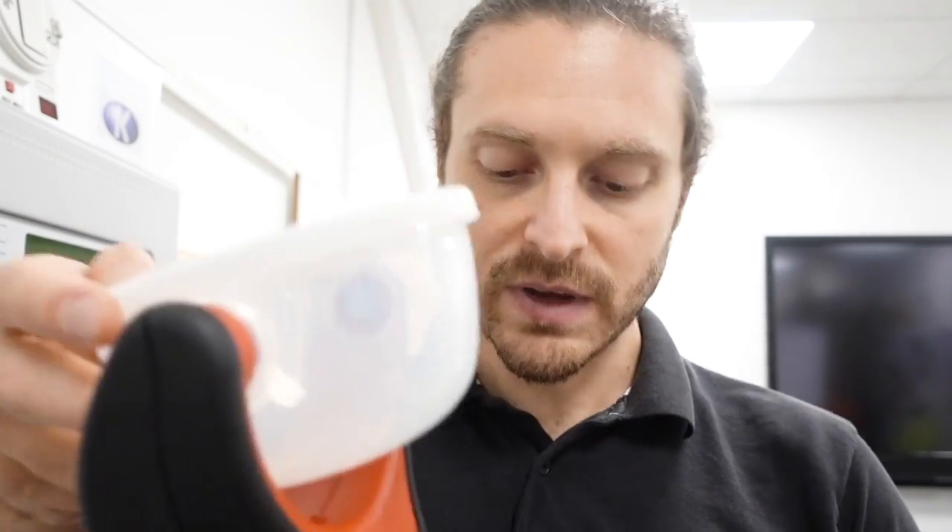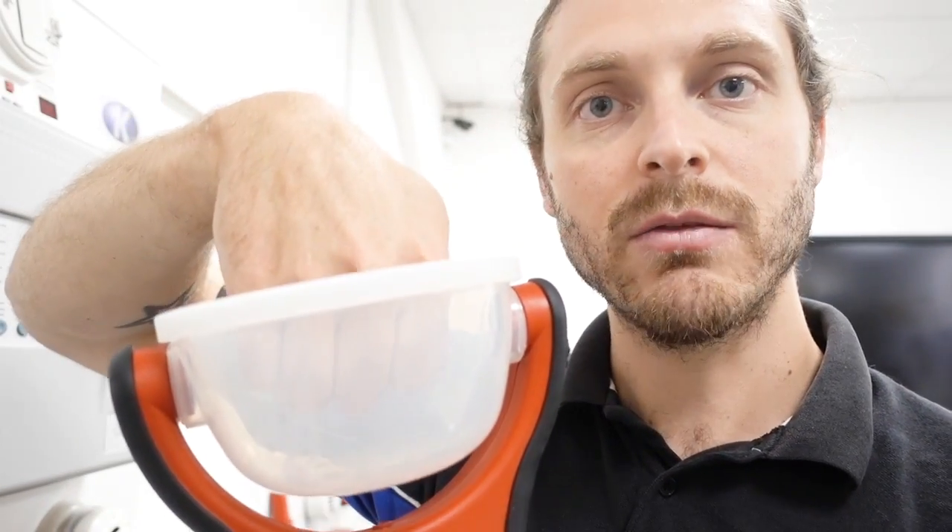As soon as something enters the cup, the sensor inside knows it and starts releasing smoke - that's what it just did there. You don't run the risk of contamination. It is battery powered, so that's something to bear in mind - you will have to charge it. I would personally have a spare battery just in case. Before doing a job, charge one up and have one on the go, just like you would with a drill. It requires a little bit more planning, whereas with the 330 you can literally shove a can of smoke in and you're away.